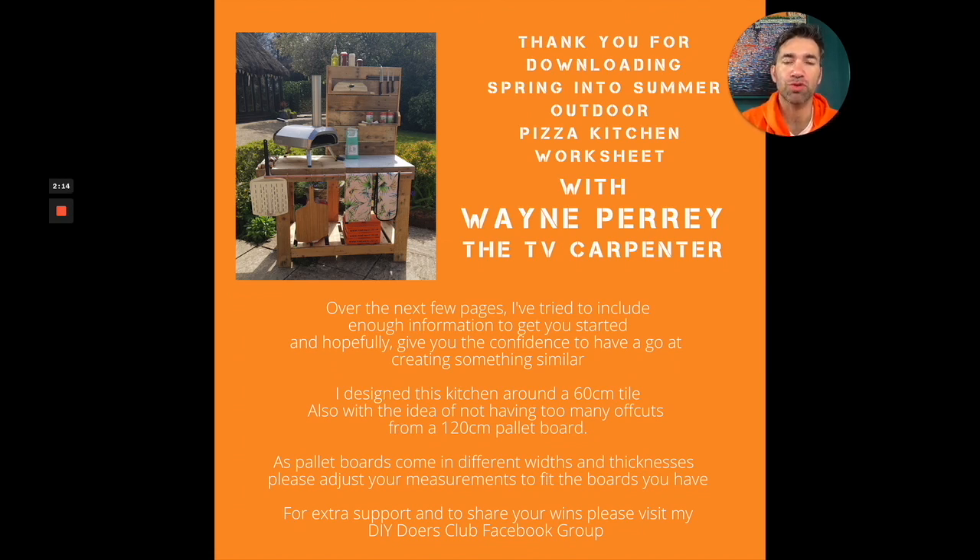So it's cheap as chips and it was just under 60 centimeters square. Pallet wood comes in maximum lengths of around 120 centimeters, so I decided to make the majority of the build around 60 centimeters so I could cut each plank in half and get double use out of it without a load of offcuts. The height is 90 centimeters, so some are a bit longer, but I use those offcuts to create the shelves. It's more cost effective and everything is available. If you have any issues, you can go to the DIY Doers Facebook group — it's a free resource where I'm there to help you.